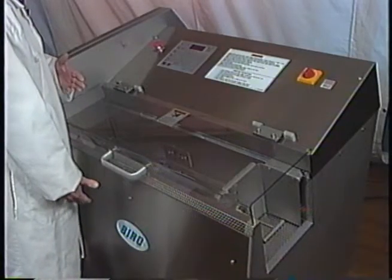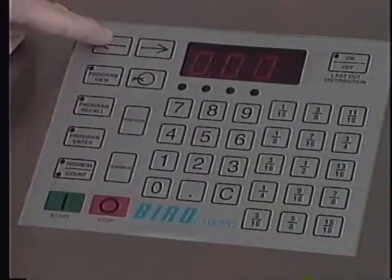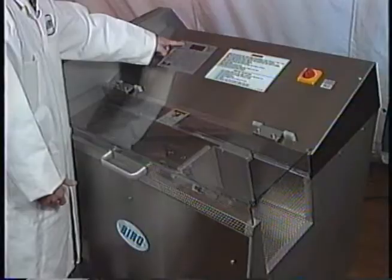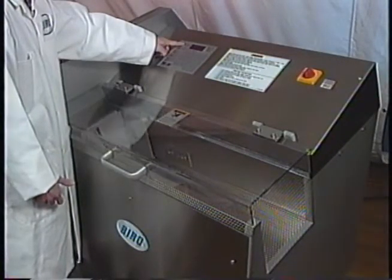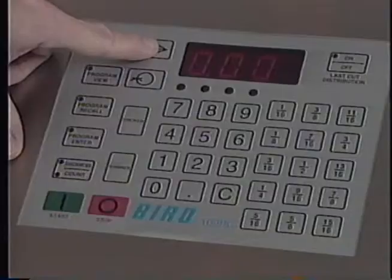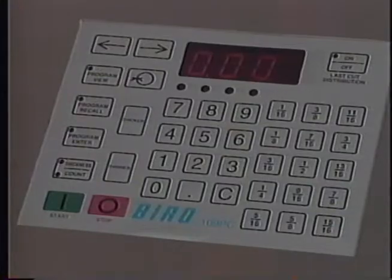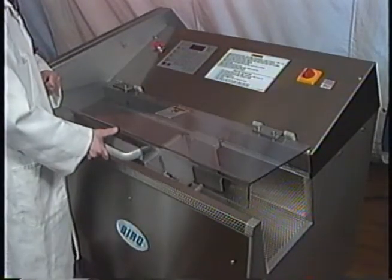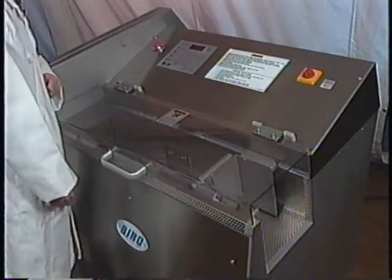Next, check the transporter or product pusher. Use the advance key to the left — the key toggles. Move the transporter all the way to the left, to the blade end position, and let it stop. Now return it to the right, letting it go all the way back to the home position. At any time you lift any lid, the transporter will stop and continue after you've closed it.